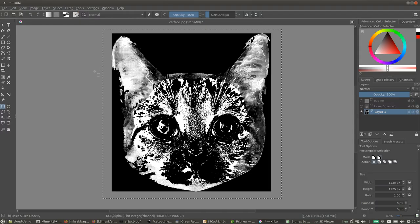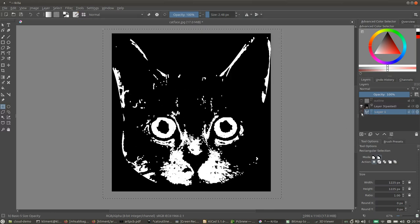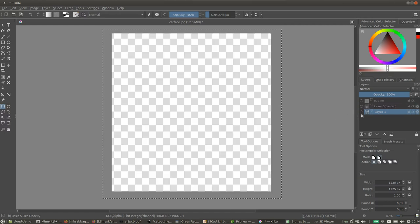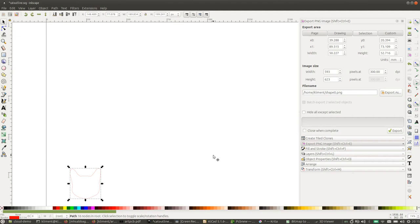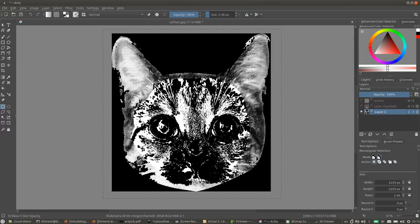So just as a reminder, going back through the steps, we separated everything that was going to be going on the mask layer. So everything is going to be gold, everything is going to be fiberglass, we separated that all onto its own layer and turned it into a binary image, so black and white. We separated the outline and exported that via Inkscape, and for this we selected a region where we used threshold, and we selected another region where we used halftone, and that converted it to a black and white image.